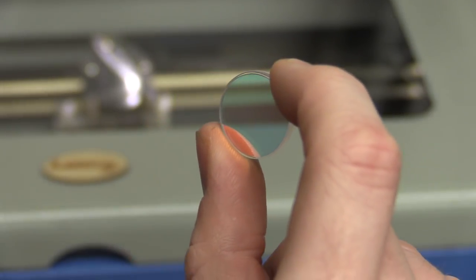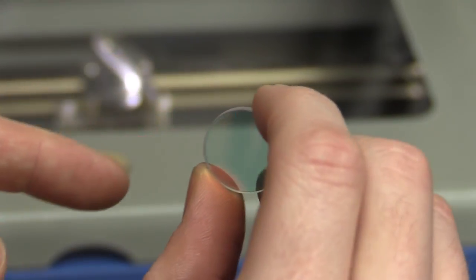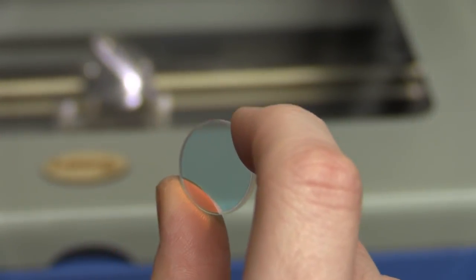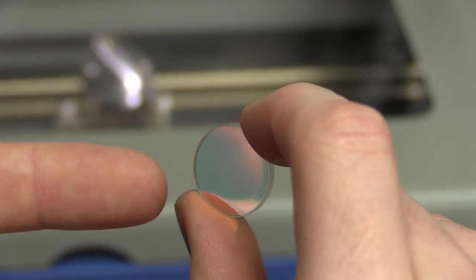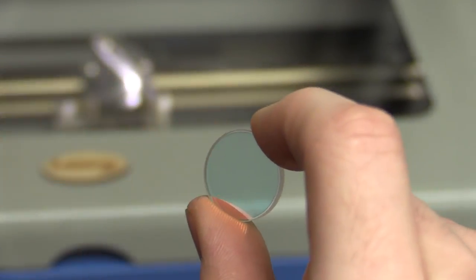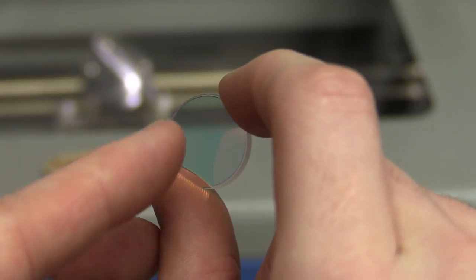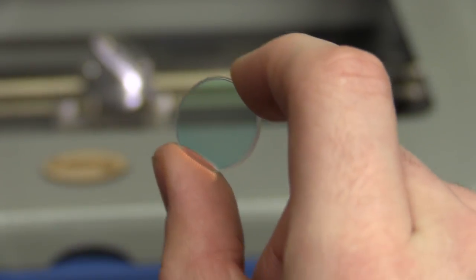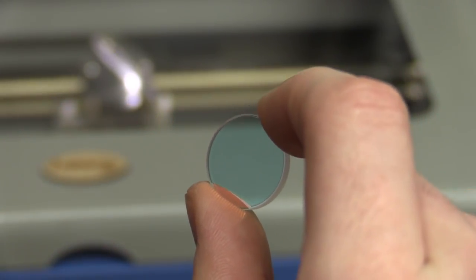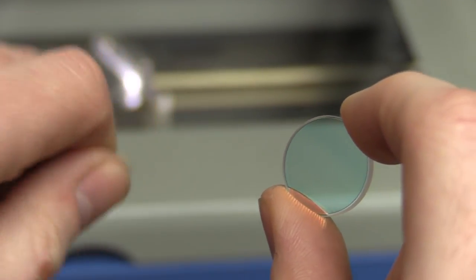So if I mount this at 45 degrees in front of the laser beam, the laser beam can go straight through the zinc selenide. If we then mount the red laser at the side of the glass, that light will be reflected and also go toward the workpiece. We will combine the beams and just have to make them line up on top of each other — we can test fire the laser to see if we hit the right spot, and if not we just rotate the laser a little bit.